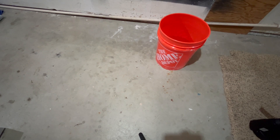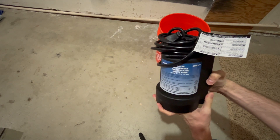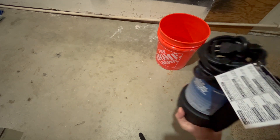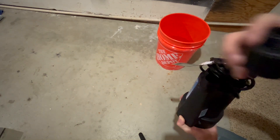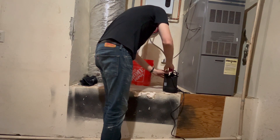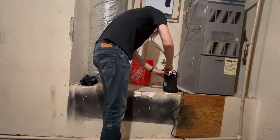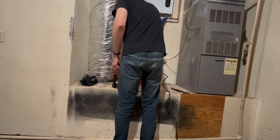To pump the cleaning solution, I used a regular submersible pump. You might recognize this pump from my hot tub draining video — it's the same one. The pump came with a washer hose adapter, so I attached that to the pump and then attached the cold washer hose to the top of it. Fill the bucket with the cleaning solution of your choice and then drop the pump into the bottom of it. You want the hot water hose connected and pointing into the bucket, though you don't necessarily need the end of it submerged. Before you run the pump, make sure your water heater is still disconnected or turned off — you don't want to waste energy heating up the cleaning solution.